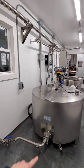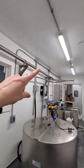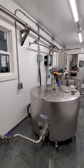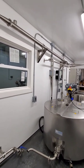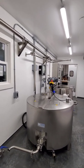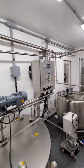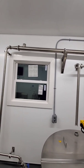This tube cooler is washed right from the vat — we fill it up, turn the pump on, circulate, and go back into the vat to wash it. In a setup with a micro dairy where they do not have a valve on the bottom, we actually run the lines to the sink and put the nipple and the pump to the sink — that's how we wash them.